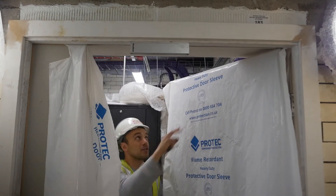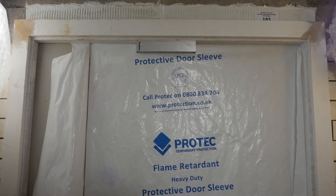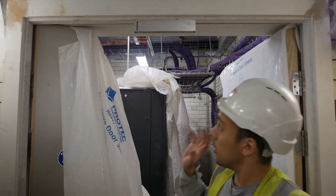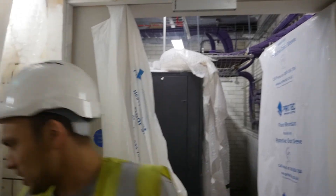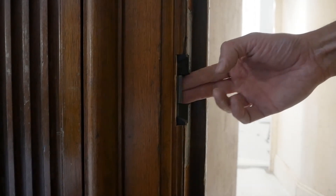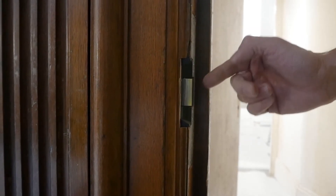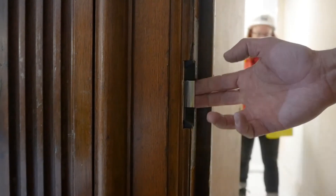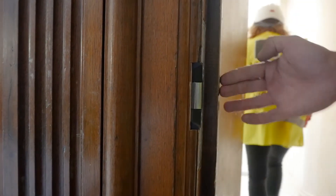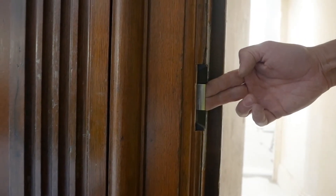It's not quite catching because of the plastic, but you can see it is locking. If I release it, that again locks the door. So that's the maglock-type door. Now there's also a latch-type door, which is slightly different — it's an actual latch in the door that engages with the latch in the frame. The only issue sometimes with these is if the door is pressing too much against the latch, it doesn't always release, and sometimes you have to let go and push it again and it'll release.